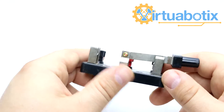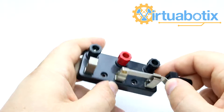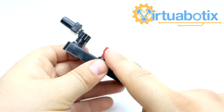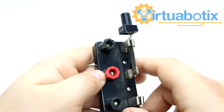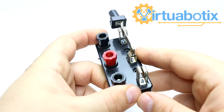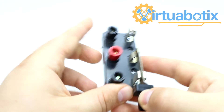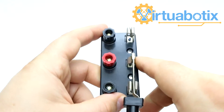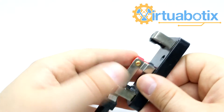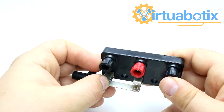Let's say that you have two circuits and you wanted to decide which one was on or off, or turn both of them off with a single switch. Basically, you put the power onto this one, or the ground depending on how you want to do it. Normally I put the high input on the control circuit, and then everything would have a common ground. If you wanted to turn on the circuit connected here, you'd have it in this position; to turn on the other circuit, put it into this position. If you want both of them off, simply leave it in that state. By doing that, you have the ability to have two circuits that won't ever be on at the same time, controlled by a single switch.